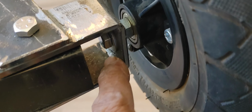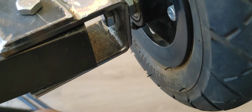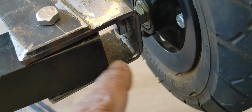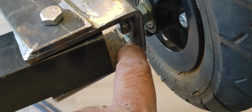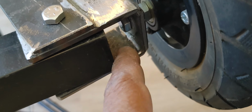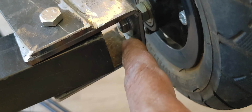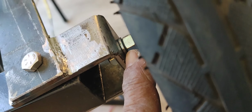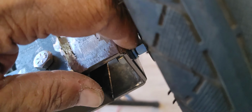The inside of this, I did it on a mill, just a vertical mini mill that I have, and I took my time, little by little, kind of letting the mill grind a curvature here to remove some of the imperfections of the welding. So it's welded on the inside as well as on the outside right here. You can see how I curved that here on a grinder and on a belt sander, which I also have.